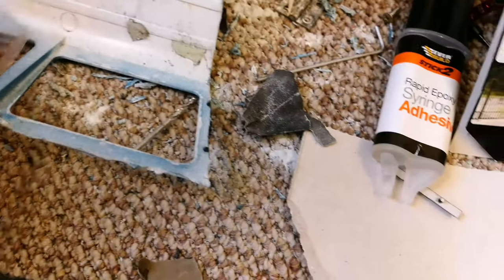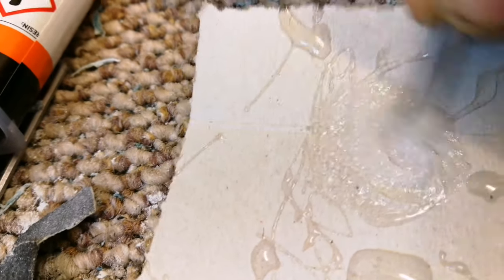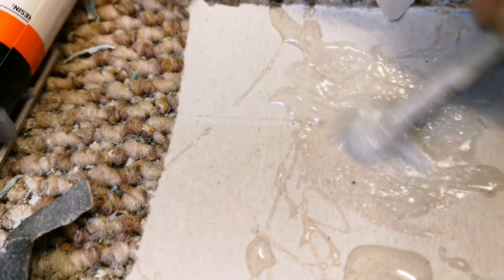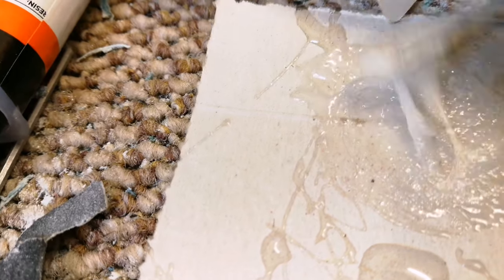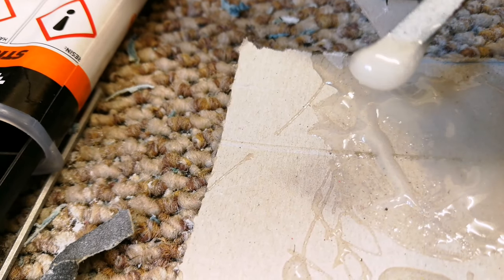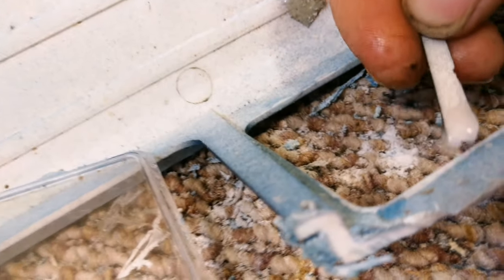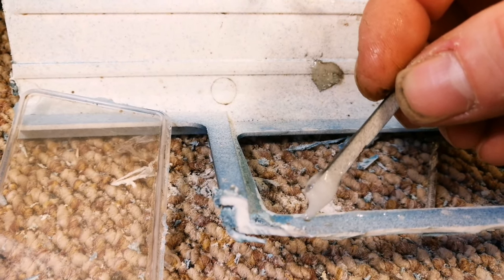Key your body first on the inside where the lip is, then mix yourself up some two-part epoxy. This batch has gelled up a little - you can see that grainy texture - which means it's been on the shelf for a while, but it'll still work fine. It just gives you a more viscous product. You don't want that much on there - just paint a bit on your inside lip, put a dribble on and drag it.